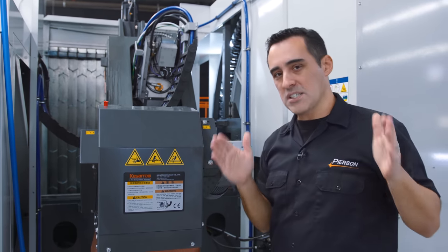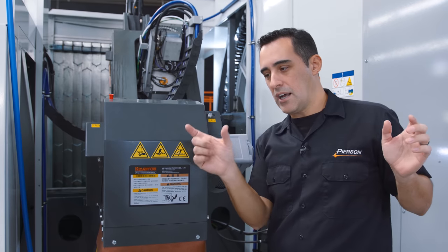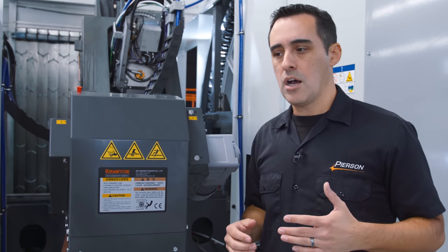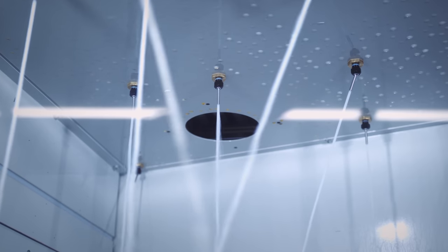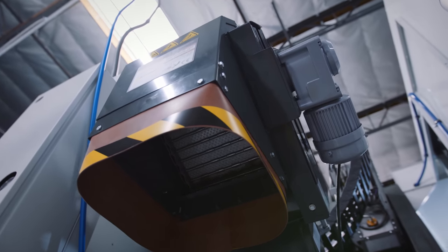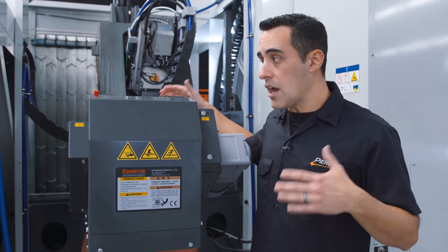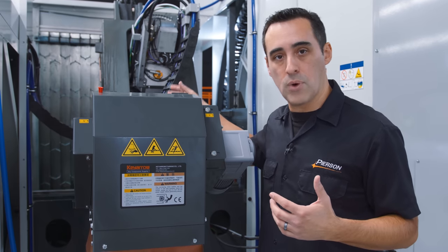Also, if you look at the spacing between the linear rails and then the distance from that front linear rail to the tip of the spindle, that's a lot shorter than the spacing between the two linear rails. Haas has also made a lot of improvements to chip evacuation. When we come around the front, you'll see there are lots of nozzles — it's like a shower in there — getting chips down into the center of the casting, out through the center of the machine, and into your chip bin. Even chips that end up in the pallet pool wash down into the center trough of the belt style chip conveyor. Taking a close look at the inside of the machine, I'm really impressed with the design — not just engineering, but the aesthetics of how everything is neatly routed.